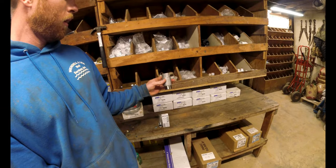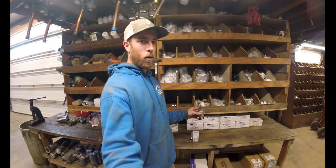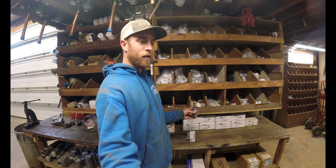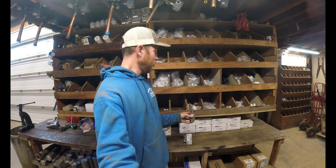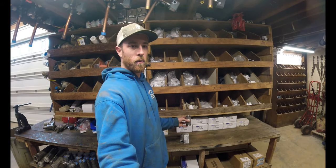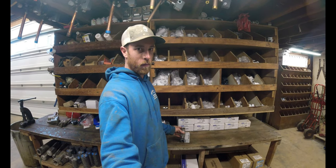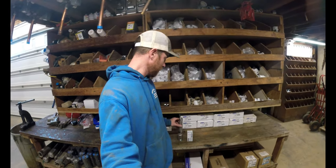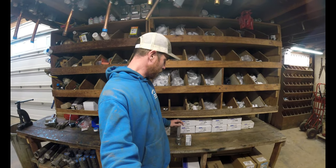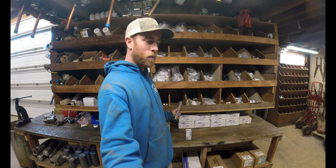If this weren't here, every time your pump cut off, water would rush back down the pipes, causing water hammer as well as putting your pump through a back-surge situation — meaning water rushing back in on top of your impellers — which can cause damage and premature failure to the pump quickly.